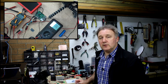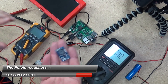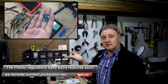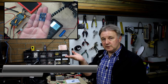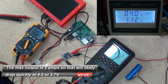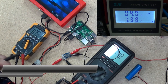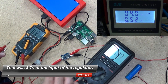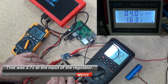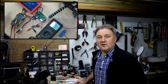Both of those are Pololu-branded regulators and they're not particularly cheap. But this little fellow I picked up off eBay for $4 — it is a 2 amp 5 volt voltage regulator. Let's see how it actually does. It's providing power with a 4 volt input, about 3.7 volts, and the output voltage is 5 volts — actually putting out 5.1 volts.